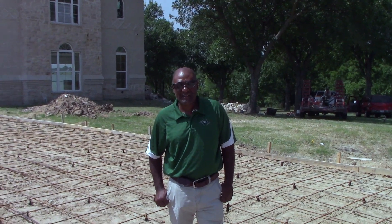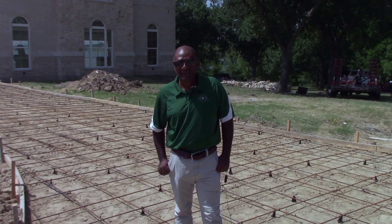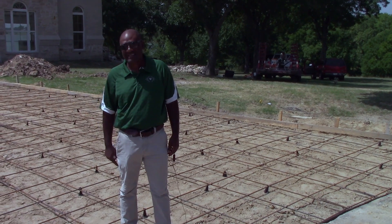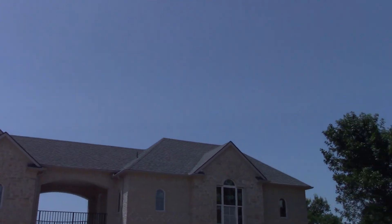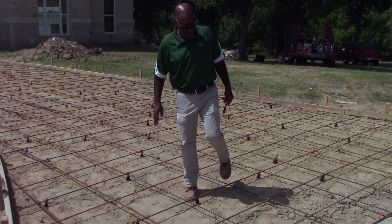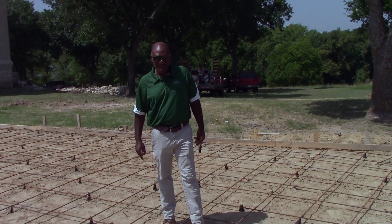Hello, good morning guys. Milton Whitley here with Whitmore Custom Home, welcome again to another show of the Buyer Appeal. Today we're going to talk about pouring concrete — not just pouring concrete, but pouring concrete in hot weather, 100 degrees. As you can see, we have all our forms already set, we're using number three rebar, the chairs are already in, and we're going to cut this every 10 feet when we pour. But let me talk about the process before we get started.